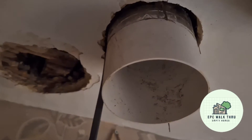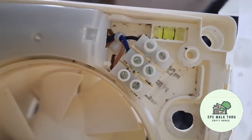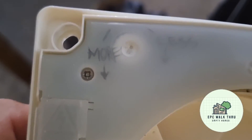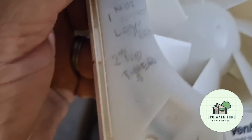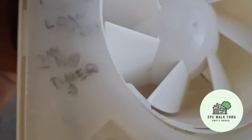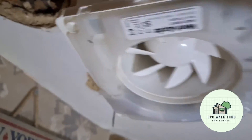I've run a roll of lighting cable and poked it up, bringing it round to my nearest live supply. I turn the lights off at the board and connect up live, neutral, and switched live — no earth needed. There's a spirit level bubble built in, though I'm mounting mine horizontally. The humidity sensitivity dial turns left for more sensitive, right for less. Under the cover there are jumpers: not connected, low speed connected, high speed, and two-in for no timer — I've set it to low speed at 12 decibels. I put some more acrylic on for purchase and push it into place with four Phillips screws.